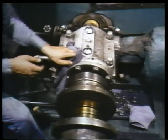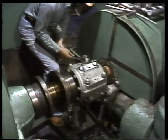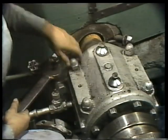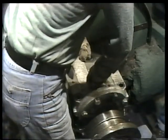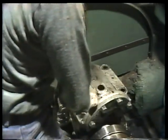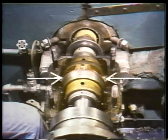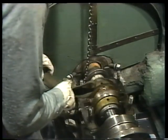The first step is to clean the outside of the housing with solvent and a rag, so we can remove it without dropping dirt inside. The disassembly starts with removing the four nuts that hold the housing in place — break them free with a wrench, then finish taking them off by hand. Once the nuts are taken off, remove the plugs from the observation ports, and by sticking your fingers down into the ports, you can lift the housing free. The upper bearing shell is the next part to come off, held in place with two dowel pins. But before removing the shell, we're going to hoist the shaft to make it easier to roll out the bottom shell.